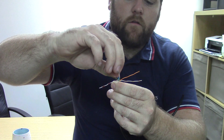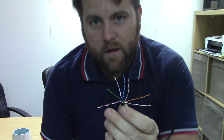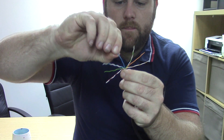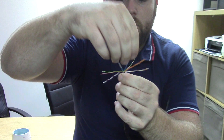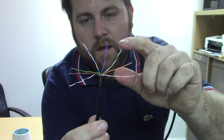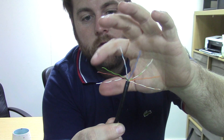A good way of straightening the wires is to run your finger down them like that. If you've got cheap Cat5, they might not straighten very well, but you need to get them straight to fit into the plug. So starting from left to right, we have the orange pair, then the white and green, then the solid blue, then the white and blue, then the solid green.